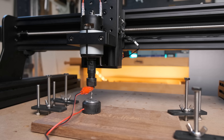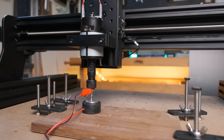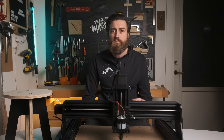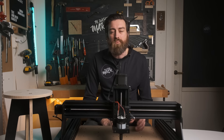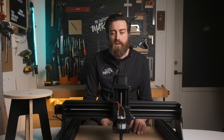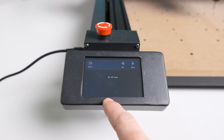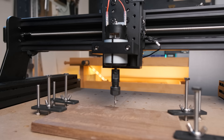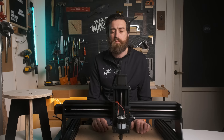I tried using the Z-probe over and over again but I couldn't get it to work. The probing worked fine, but when the carve starts it was just carving mid-air — like it wasn't calculating for the thickness of the probe at all. They did provide me with a video on how to use the probe by resetting the Z-axis after probing, but that didn't work either. So I did it the old-fashioned way by placing my bit on top of the work surface, which works just fine. Then I realized another weird thing: on the display there are three menus — one of them is to control the machine, where you can actually activate the spindle. But when you go to the second menu to start your engrave, there is no button to actually turn the spindle on. And the spindle wouldn't turn on by itself when I was starting a carve. It might be a G-code issue, but they should have the option in the engrave menu to turn the spindle on as well.